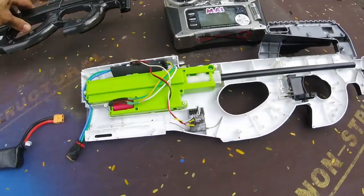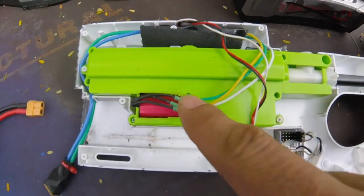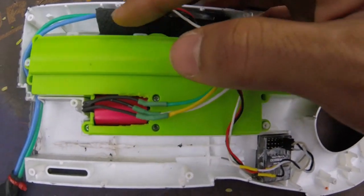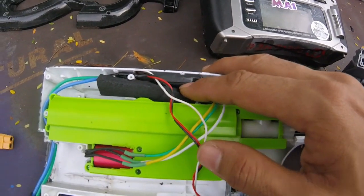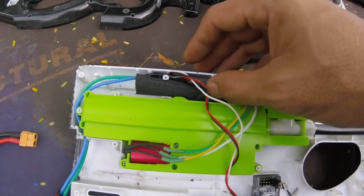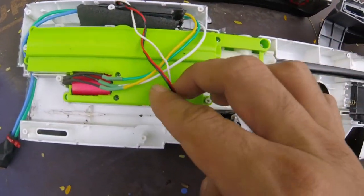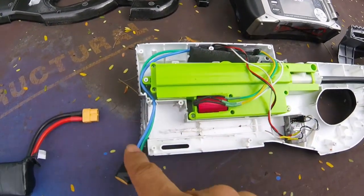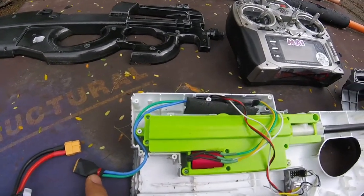So instead, I've opted for a rewire. As you can see here, I've taken the terminals off and added silicone wire. I am using an older SimonK 30 amp ESC for a multi-rotor, so this has a big heatsink on it. It also has a 5 volt BEC at 2 amp, which powers my radio, and I've added an XT60 and melted a hole into the P90 to allow it to route through.